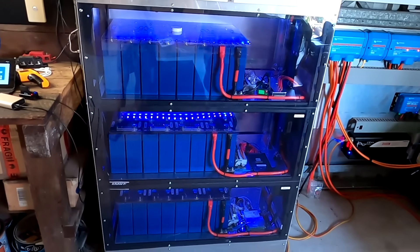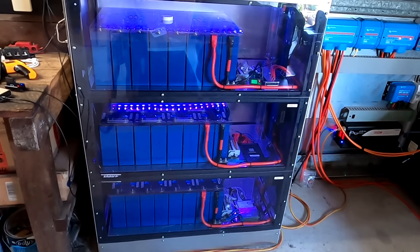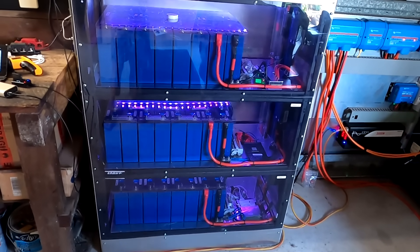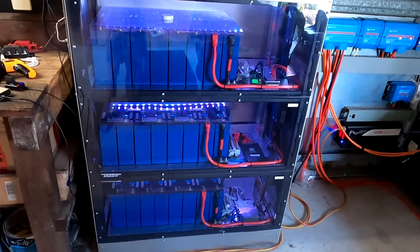The main reason for this cleanup was to get access to the battery shelf — we want to build an extension in a future video. But in today's video we want to do something completely different with the battery shelf, something I've wanted to do for a while. You may remember when we built this battery, we fully top-balanced all the battery banks — we had an active balancer connected and balanced all the banks to over 3.6 volts.